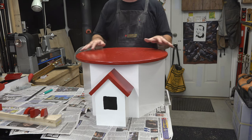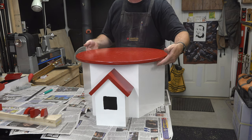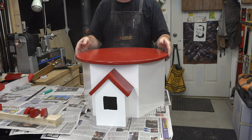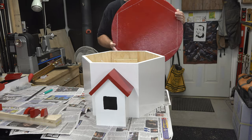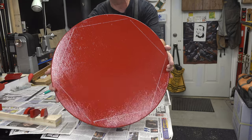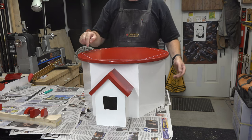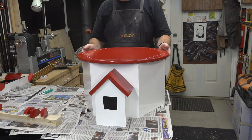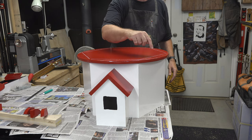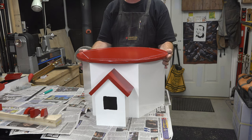I've placed the 22-inch disc on top of the base so it overhangs two inches at each flat point. I've used chalk to outline the hexagon as a guide, then I'll apply a little adhesive, clamp it, and shoot some brad nails down through the inside of the chalk marks to firmly secure it to the base.